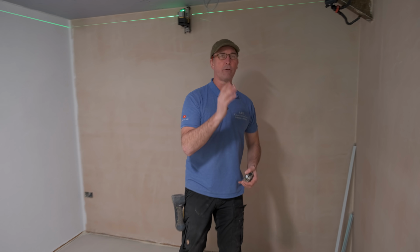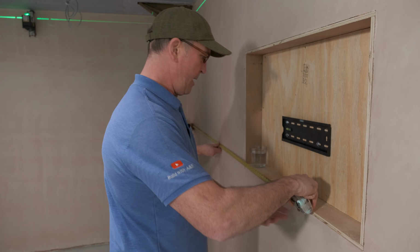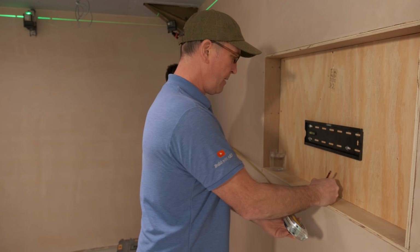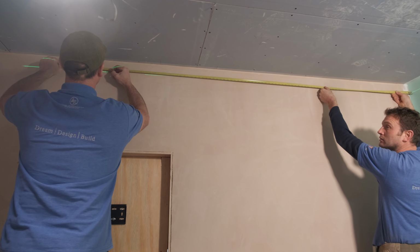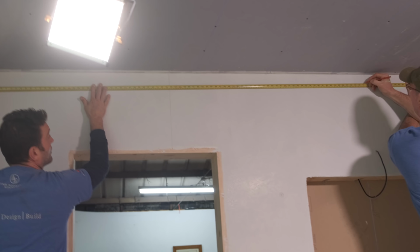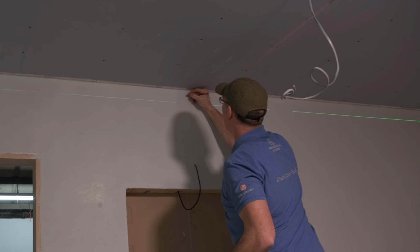And what we're going to do, we're going to find the center, because all the panels are 600 by 600. There you go, that's 90 and a half. So I'm just, here you go, split the difference. There it is there. That's my center. So center, 90 and 3/4. 90 and 3/4, that's there, mate. Sweet, so that's my center, Pete, okay?